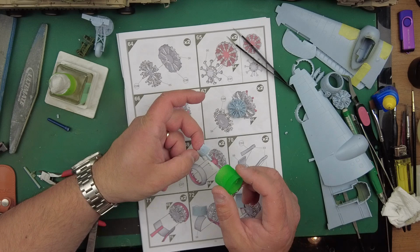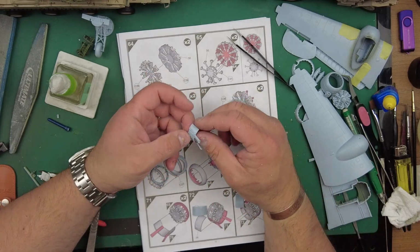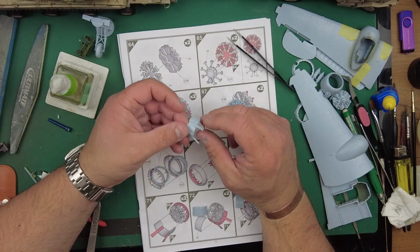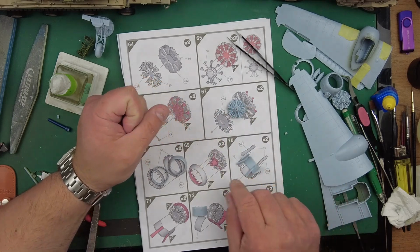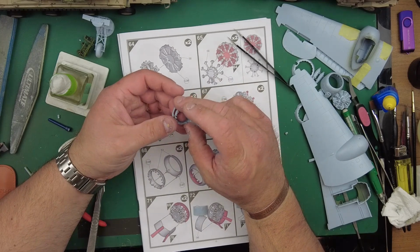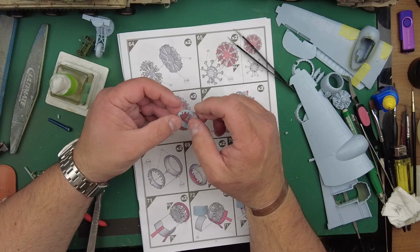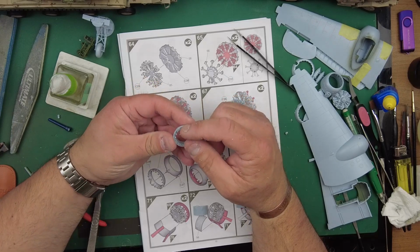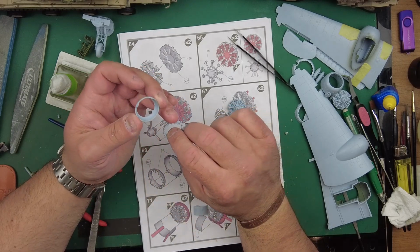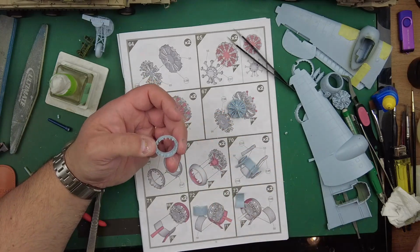It is quite crucial when you think of the engine cowling and retaining the correct profile around the exterior of the engine. So there's the exhaust on. We can leave that part. The next thing we've got to do is sort out the engine exhaust collector. This will only go one way. You'll notice those two marks there and there, and there's corresponding marks there and there. They adjoin nicely like that.